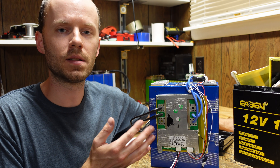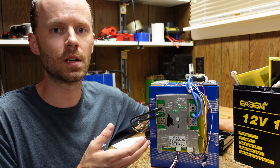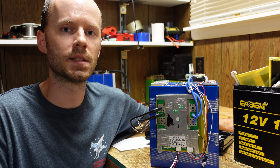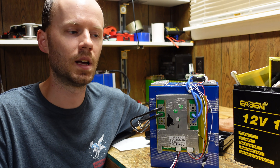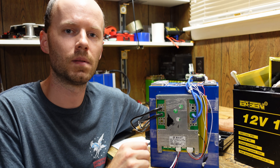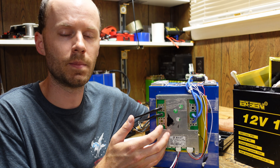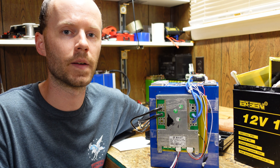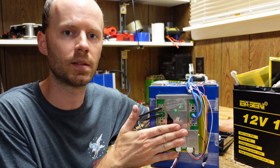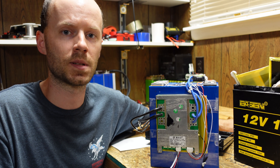I really feel this is a great deal for what this battery costs. Unfortunately there are no US distributors currently — they're looking for some but don't have any yet. It can be purchased on Alibaba; for me the estimate is $351, though pricing will vary by location. I'm still not sure what brand the cells are, but they appear to be grade A — no bulging, no damage, laser welded with nice thick aluminum tabs. We get a JBD BMS, which is a quality BMS, whereas some vendors just throw in whatever's cheap.